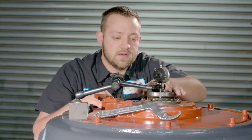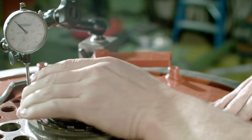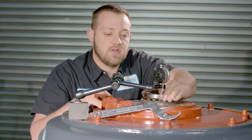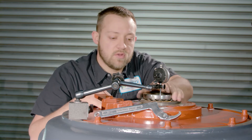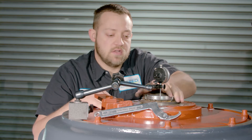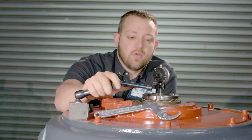Having done this for a while, I've run into several different problems. One of them is cocking the bearing cap to the shaft and then trying to set end play. What happens is you get a misreading of end play, and when you go to test run it or install it, you have the possibility of damaging both bearings.